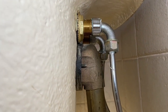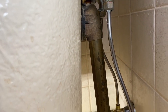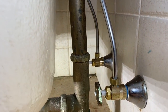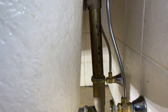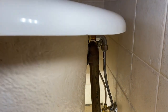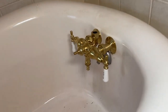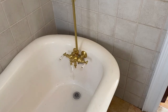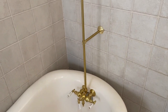Looking underneath — I used the original goosenecks and original risers because they were still viable. On the goosenecks I put Teflon tape on the face, and I used waterproof silicone lubricant on the male threads of the tub faucet so the nuts would run up smoothly. I made them up with a six-inch wrench, whacked them up, turned the water on, and everything was watertight. I was very happy with it. Here's the finished product.